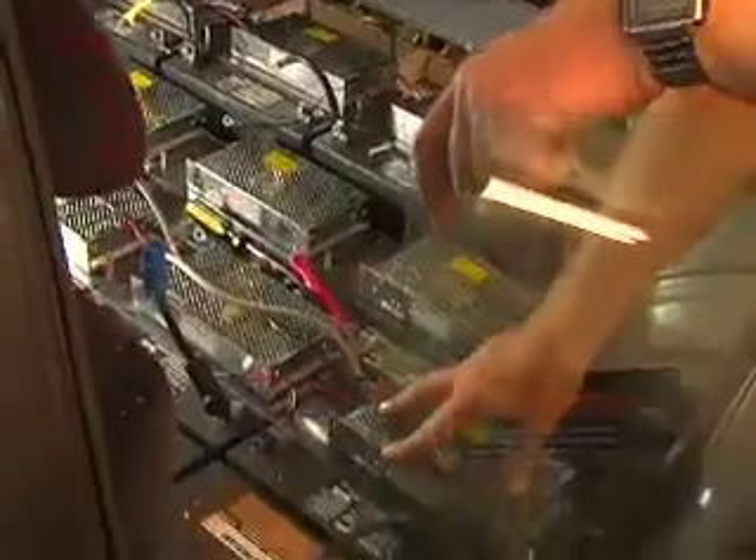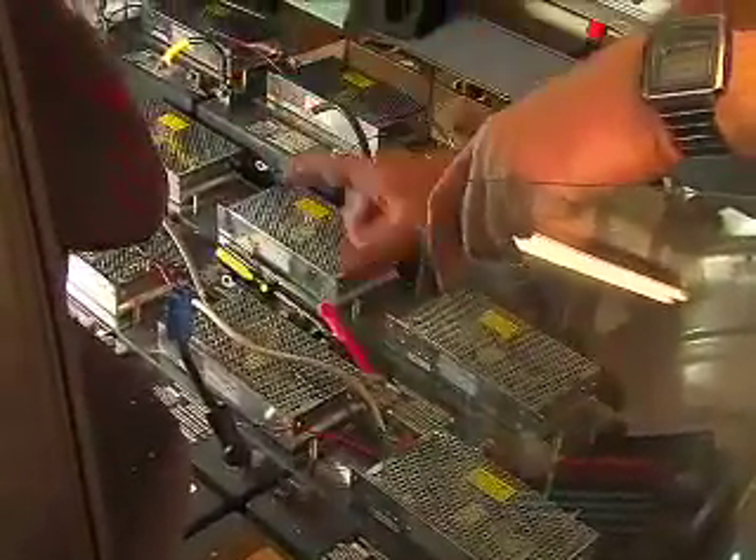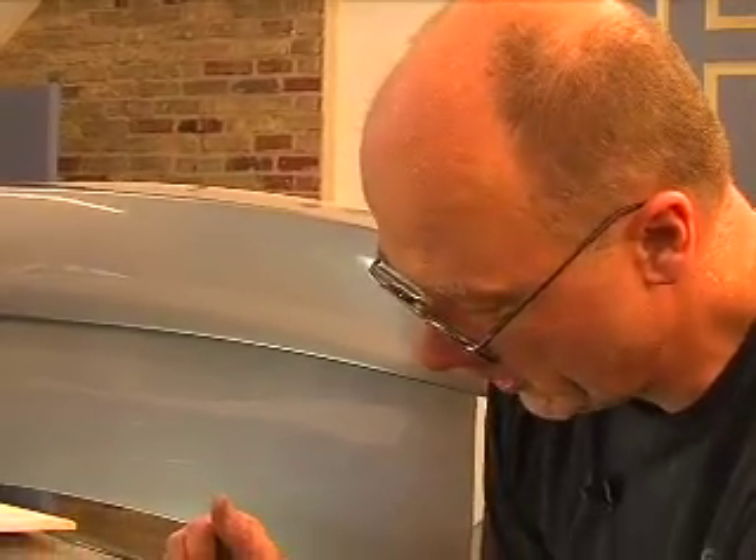I'm going to run each row of batteries on a separate power line, and I can switch those on and off so I don't overload the circuit when I turn a bank on. If I put everything on at once — they're 100-watt chargers — that'd be 27 amps, which would be a little much. By turning on one bank at a time, I'll be able to control how much power I'm drawing from an outlet until things settle down, and then have everything on to top off the charge.